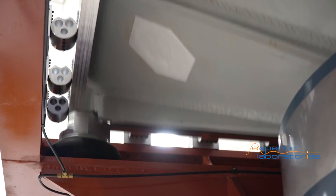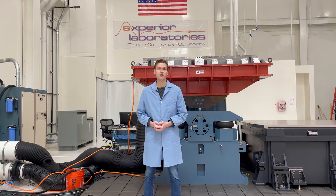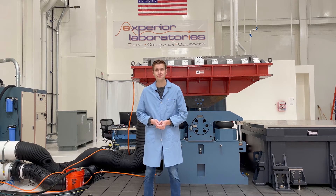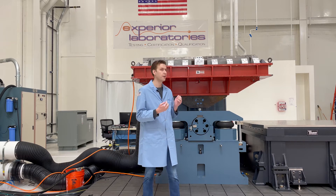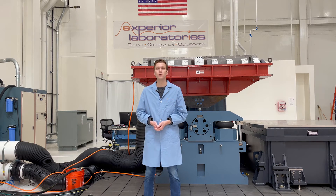For the load support, Firestone air mount isolators were chosen with the design goal of maximizing load capability, isolating vibration, and maintaining the natural frequency below the range of testing. The result: moments and load travel directly through the steel frame into the shaker body. Load bypasses the trunnion joint via leveling wedges to go directly to the shaker base and subsequently to the building's isolated concrete base.